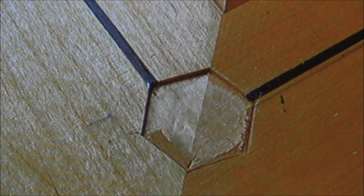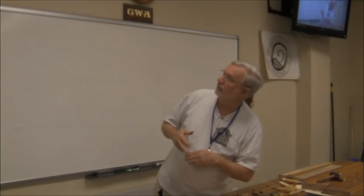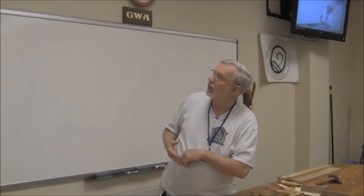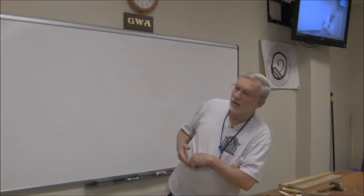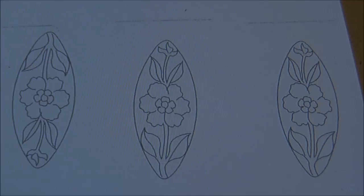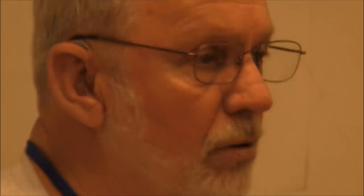Do you use a Dremel with a flat bottom bit? Yes, a little flat bottom bit. A regular Dremel, not a router — they have some really great ones today. Where that miter is in the corner, is it humped up? It looks like it is but it's not flat. That would add another degree of difficulty. That's not a raised panel. And you can see what I was talking about — route up and then clean out. That's how simple it is to put that in. On my little chest I'm building, I just put two of these, one on each side, and it gives the chest an entirely different feel.